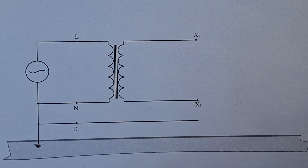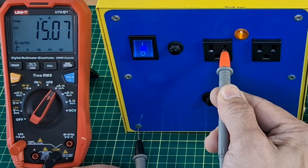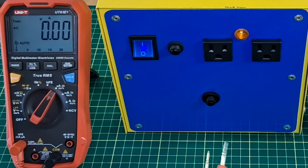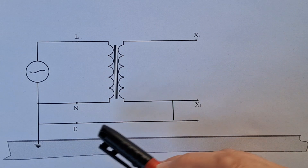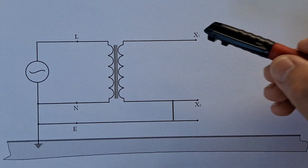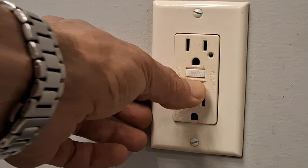But the truth is a little different — current is flowing to ground; it is called transformer leakage current. In this case it is so small and insignificant that a regular person will not feel anything. It could be a different story for a person with a pacemaker or someone with a wire touching an open wound. Warning: there are separation transformers on the market with the secondary winding grounded — they serve a different purpose and touching their outlets can be deadly. Why do we use grounding? Do your own research.